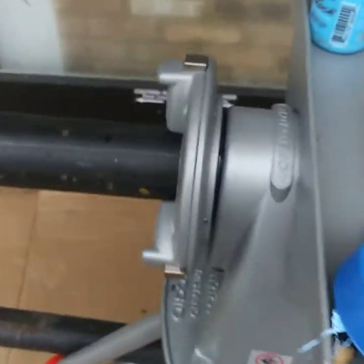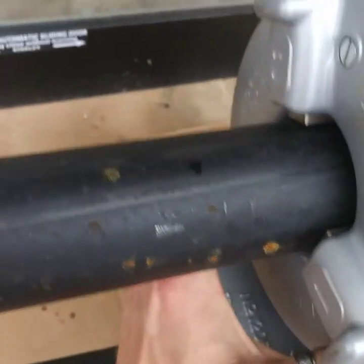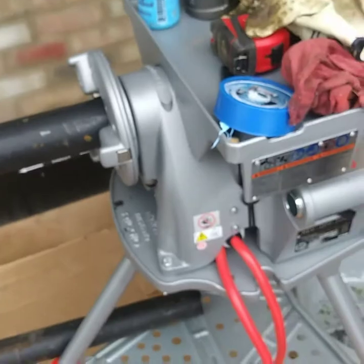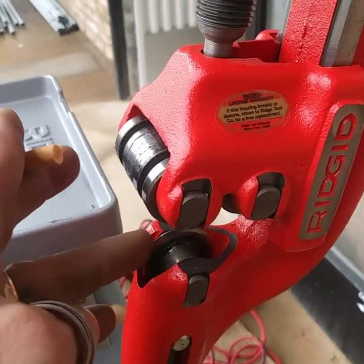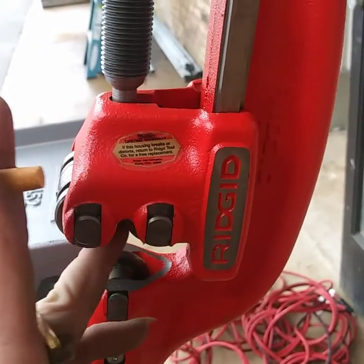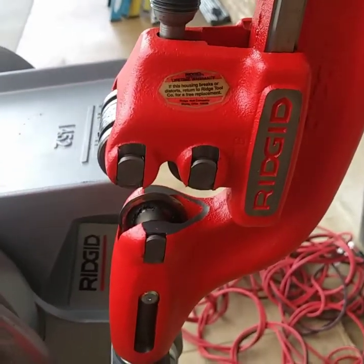Also on the back side you got a set of stabilizers — it'll go to the reverse. That's to help hold the pipe straight. And to cut, thread your pipe — make sure the blade is on your mark and make sure your pipe is landed in between these two wheels so that it turns properly. Otherwise you're going to cut crooked.